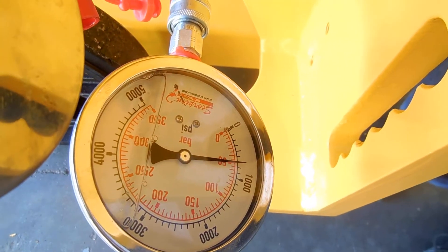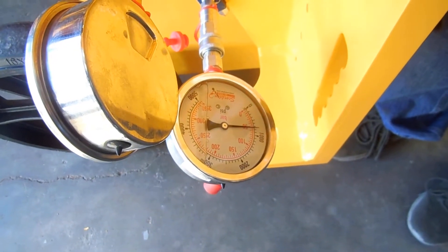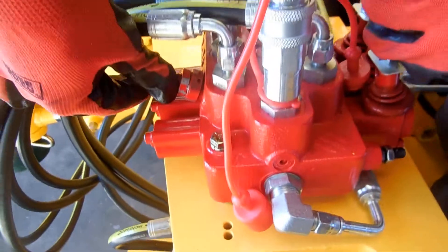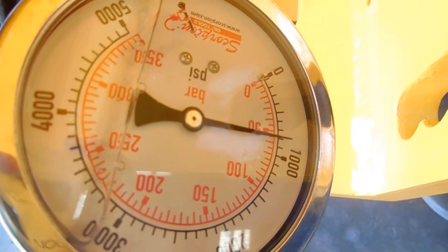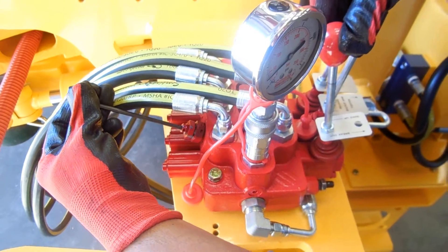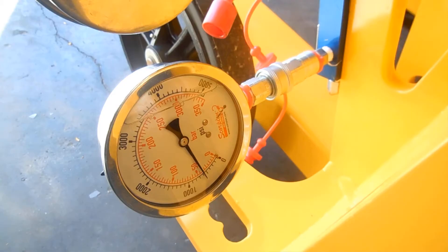For example, using the Scorpion calculator, if you determine that you need 500 psi but no more to achieve the desired torque, then you would set your system pressure significantly above that — say 800 or 1000 psi — and then independently limit the makeup pressure to the desired 500 psi. Once the machine reaches that makeup pressure, it will start to dump so as not to over-torque the joint. Once the makeup pressure is achieved, you simply lock the lock nut back into place and operate the Scorpion. Here he has dialed it back down to 500 psi, again achieving a good reading by adjusting the makeup lever all the way down to get a constant reading so that he can see the adjusted pressure levels.